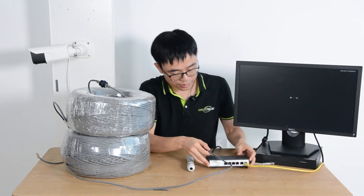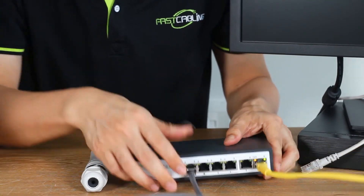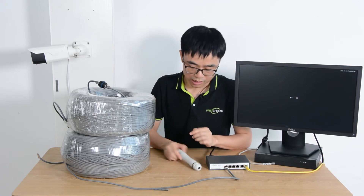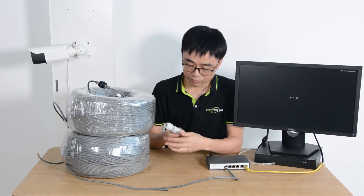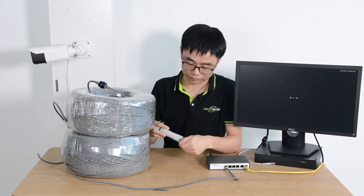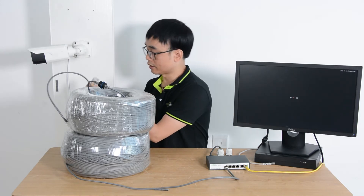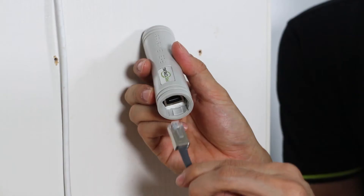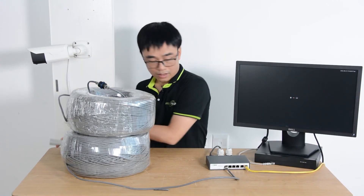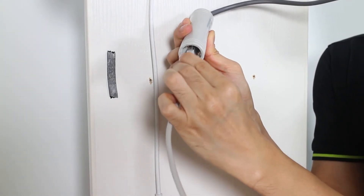At the back end, I'm going to connect the cable to port 1 — it could also be port 2, since only port 1 and port 2 support long distance PoE. I also need to install the PoE adapter next to the camera to return the signal for long distance. I'll find the cable and connect it to the input of the PoE adapter, and I also need the patch cord to connect the output to the camera.